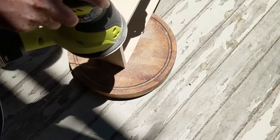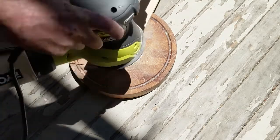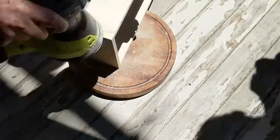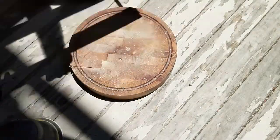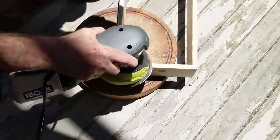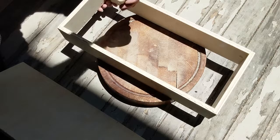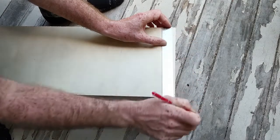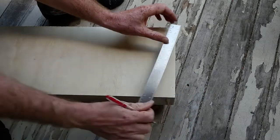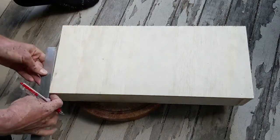Before attaching the base panel, we're going to do some sanding to make sure everything is smooth and even. Now to glue the base panel on — similar process as the side panels, the same toolbox, same copy of the classic culinary work of literature Larousse Gastronomique. We mark the positions of the 10 screws for the base panel before drilling the guide holes. I want the screws to be invisible on the finished product, so I also drill a very shallow depth with a thicker bit for the screw heads to sink into.